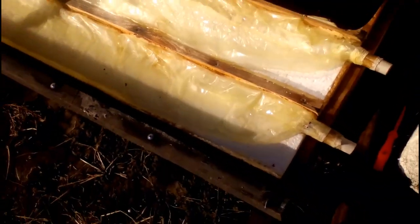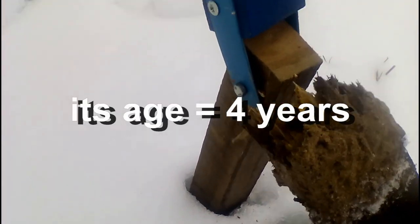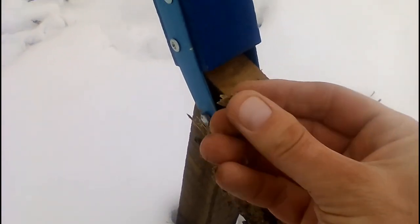Unfortunately, higher water temperatures will reduce the lifespan of these sleeves below 10 or 15 years, and this may require the use of a more heat-resistant polymer — for example, high-density polyethylene or polypropylene. In addition, we may need to make periodic replacements of the wooden stakes. A pine stake without antiseptic impregnation has a lifespan of about 4 years, but antiseptic impregnation can increase its lifespan several times.